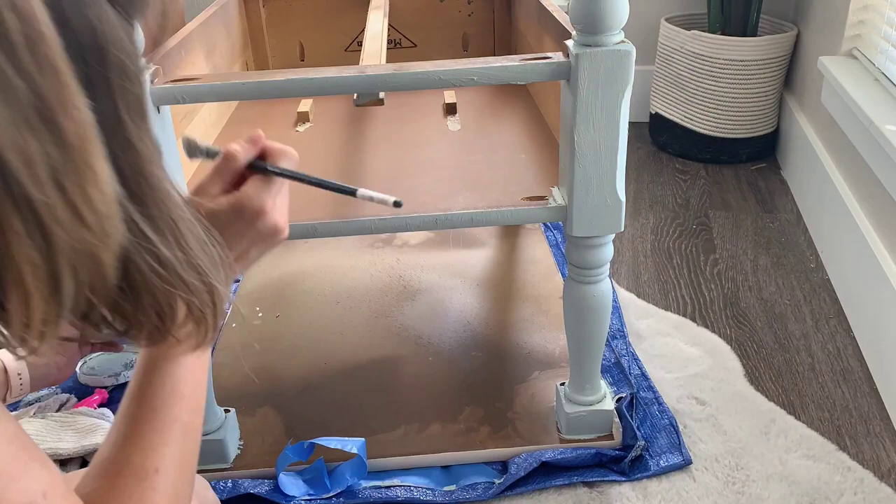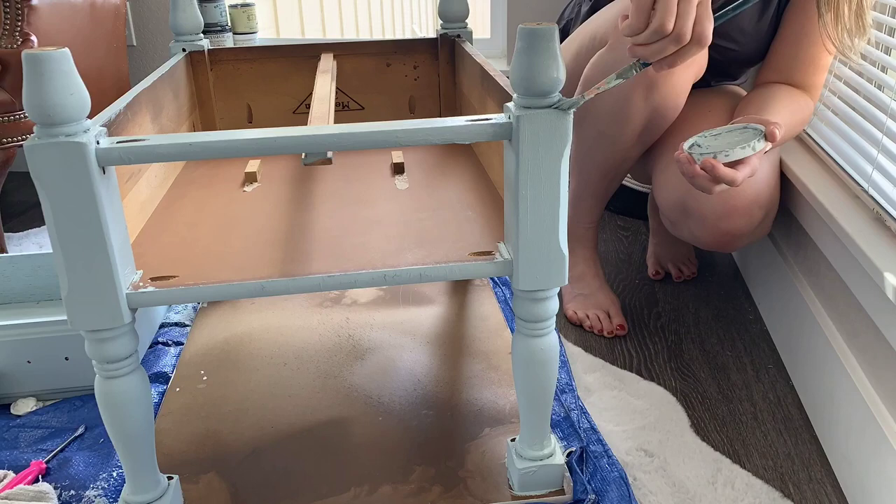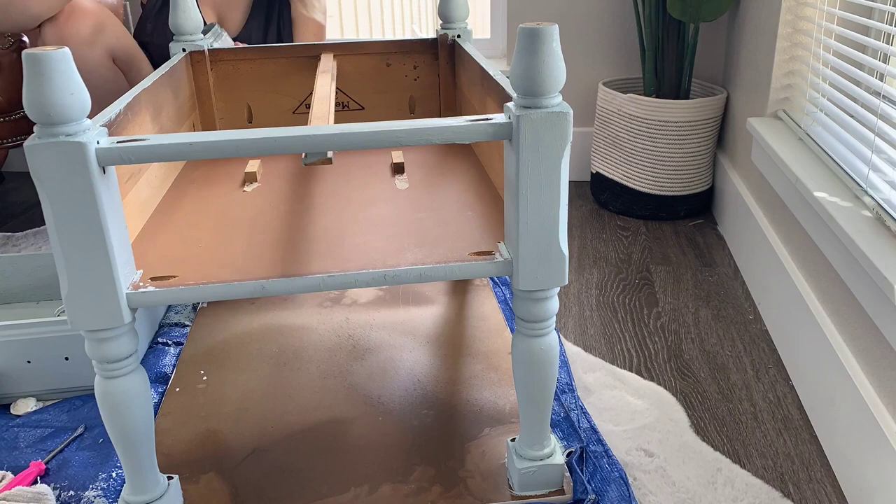I went in with a small artist brush to help achieve the little detailed areas that were missed when the piece was flipped right side up. This just took a couple minutes and a couple of coats — it dries really fast. But I really think it makes all the difference with how this piece ends up looking, especially when I go to sell it afterwards. Next up, I'm applying my first layer of gel stain.